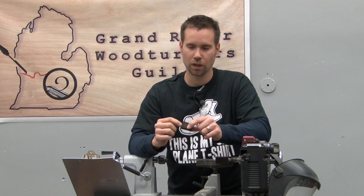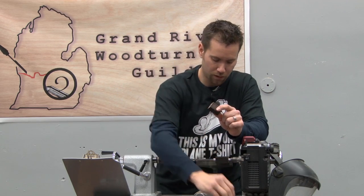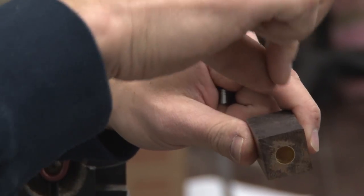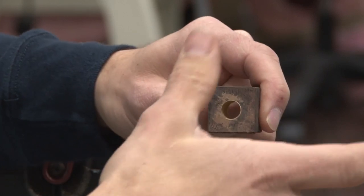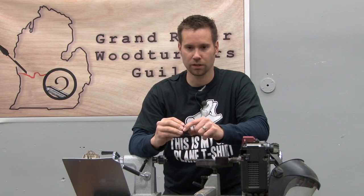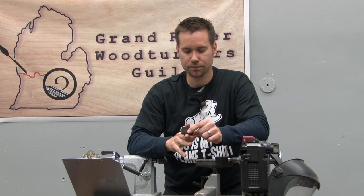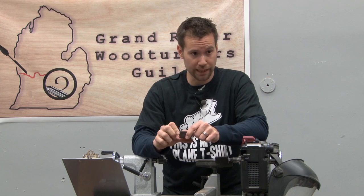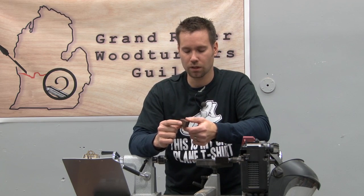What I use to glue my bushings in is a thick CA glue. Okay. You start out with just inserting your bushing at the tip of your hole, run a bead, and as I insert it, I twist it so you're getting a continuous film of glue surrounding both your bushing and the inside of your blank. Okay, and then I always cut my material a little bit longer than my insert for finished sanding and or cutting after you're done with the gluing drying process. And so you're going to want to trim it or sand it up to your insert.